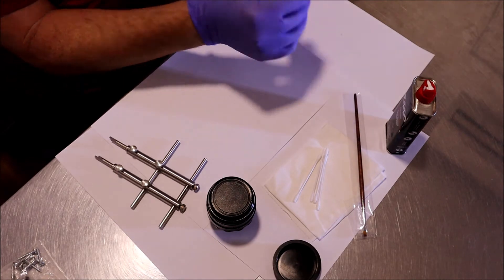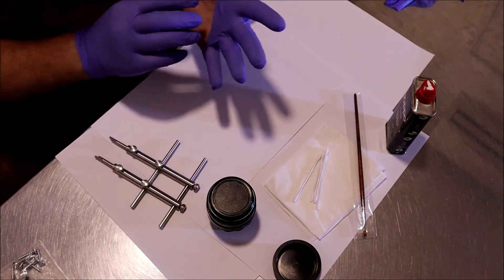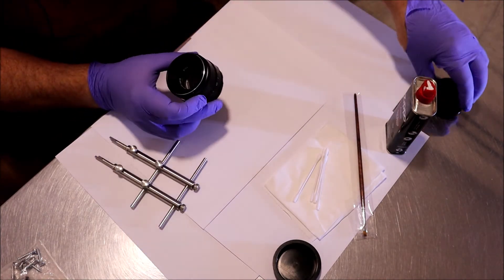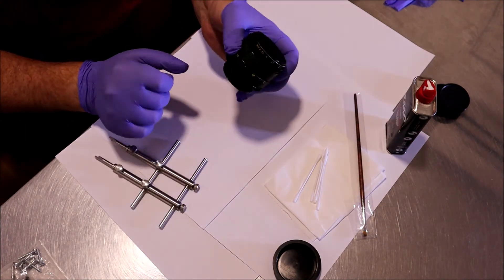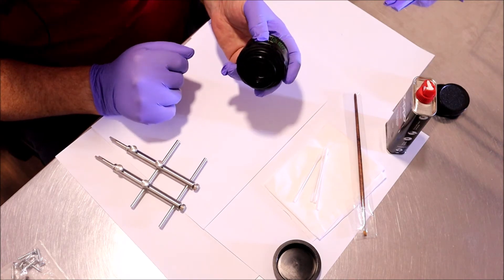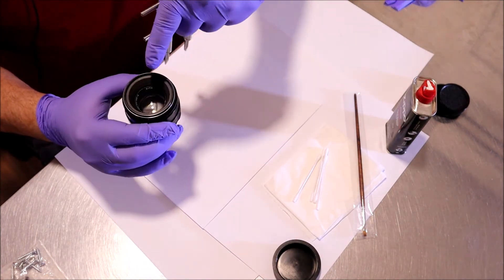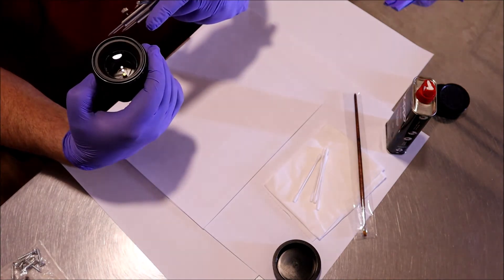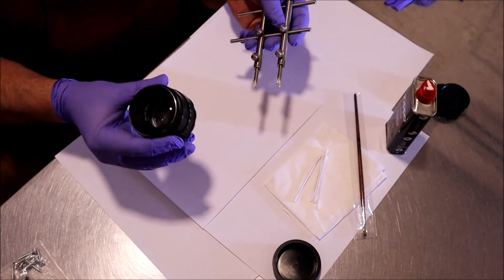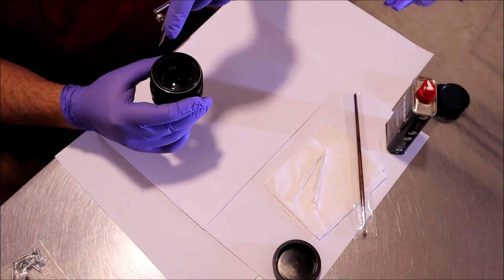I broke my glove — well, as long as I've got the fingers in place it's good enough. First thing you want to do is remove the caps. This is the M42 mount — unscrewing that now. The original version was an L39 mount, but this one is M42. Then we take off the front element. Inside we have the name plate which says Helios 44-2, 58mm f/2, and the Valdai factory logo.